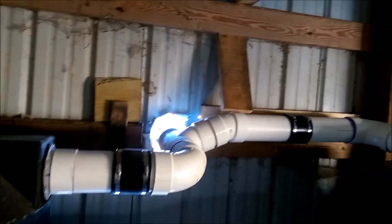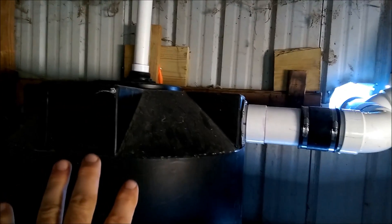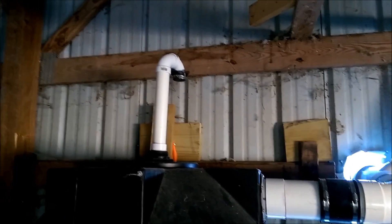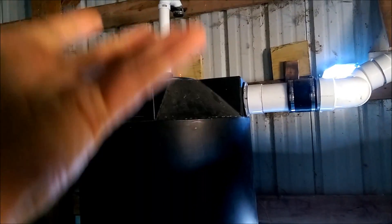You can see there's a slope — I sloped the pipe down so no matter what, it'll automatically travel down and hit this first flush diverter. That's a 250-gallon first flush diverter. At the top I put some three-quarter inch pipe with screen — double-plied to keep the mosquitoes out. You'll need that with this kind of setup because the water fills it up and the air needs a place to escape the tank.